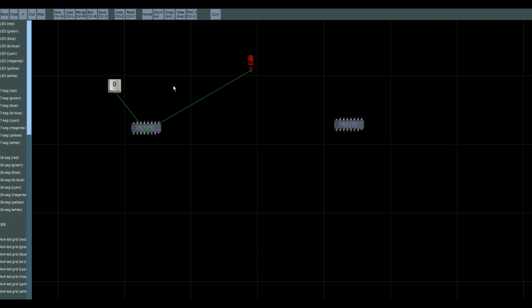So every time the bit 1, which represents the number 1 in decimal, happens, our lamp will light. Every single time. And what will happen is then, so we've got QA and QB and QC and QD. There are 4 bits. They will turn on and they will go up in binary, and we can add in basically the other stuff to see that happening. Once we've hit the top of our 4 bits, there will be a carry, and the carry is another pin, and the carry will carry across to the other chip, but it will become the input on its clock.